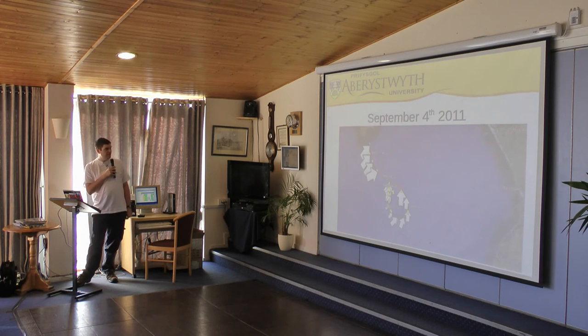And on the final day, it ended up north in the bay, and actually we get this interesting scenario right at the end, where there's quite a strong wind. I think this is about a 20 knot wind, but there's a weak tidal current coming straight against the boat. Now in the past, when we sail these boats, even a weak tidal current was actually enough to stop them moving, so this is about half a knot of tide. Yet it actually still makes progress at over one knot towards the beach.